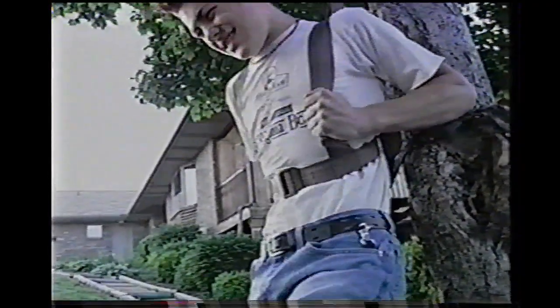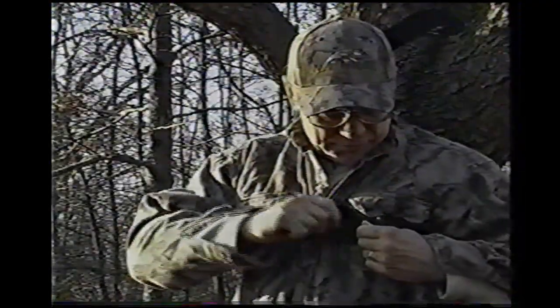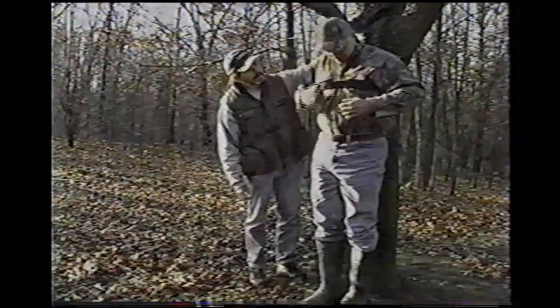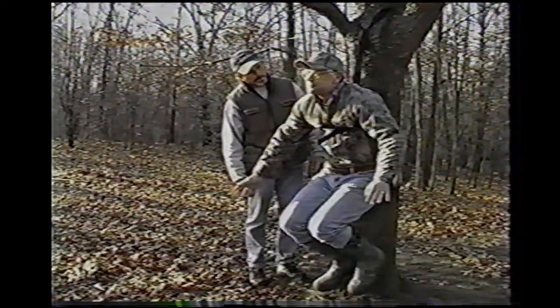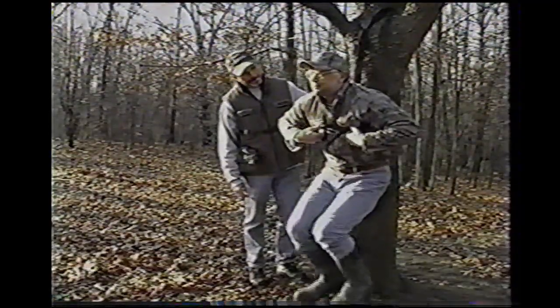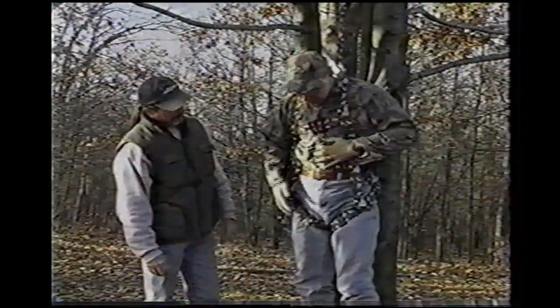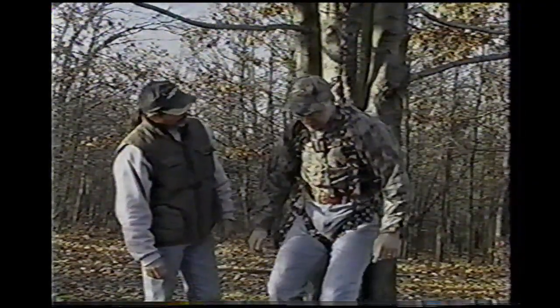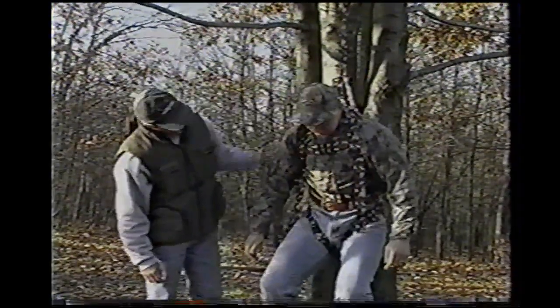The stress and pressures associated with both types is similar and significant. Make certain that you test the chest belt and chest harness at home, at ground level. With an able-bodied adult standing by, attach the tether at head height and gently flex your knees in order to feel the restrictions and stresses associated with hanging from these types of fall restraint systems. If you consider the stress excessive, we recommend that you purchase and use a full body harness.